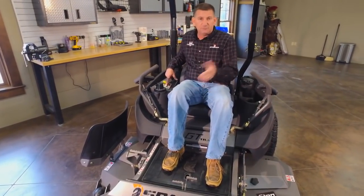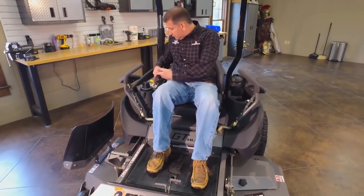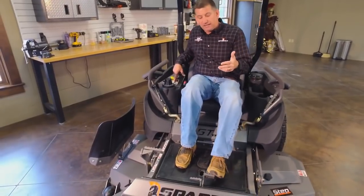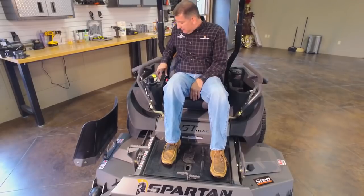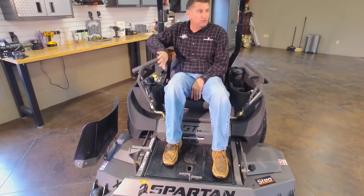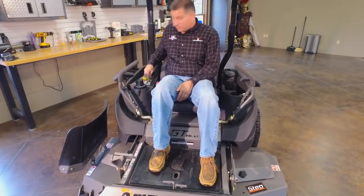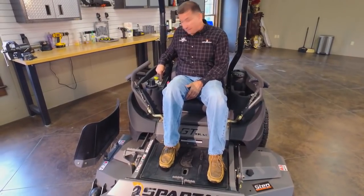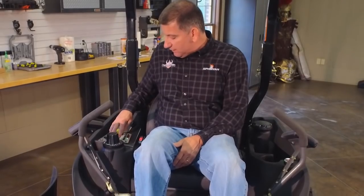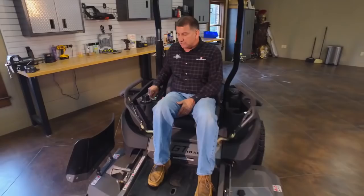If a customer buys a machine and says it won't start, then you can say, well, what's it say on your instrument panel? It says parking brake, and you say, well, apply your parking brake. And if your handle's not all the way in neutral, it'll show up here. So then it lets the customer know to fold it out to be able to start the machine. And when it goes to green, then it's ready to start. So you just push a button and hold it to start, then push a button and hold it to stop the machine. But it's really key to have all these features to where it tells you when to change your oil, when the machine needs to be serviced.